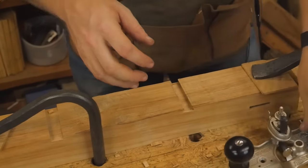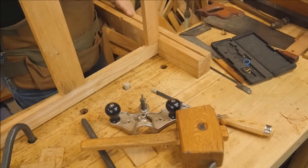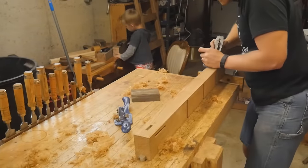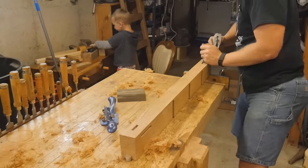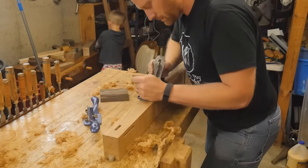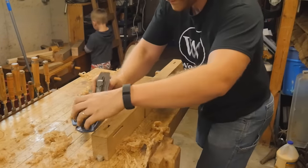This is actually a lot of fun. Now I can actually test them and see how well they slide in — I was very pleased, they came out fairly well. Now it's time to do the actual glue-up on the leg assemblies. I do a final smoothing, taking off a very, very thin amount on all surfaces, bringing them all flat, taking out any dings, marks, and pencil lines, and getting them all ready for the final glue-up.